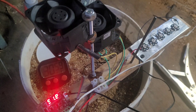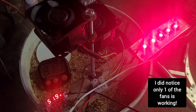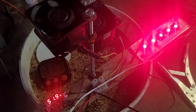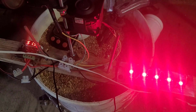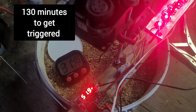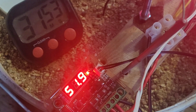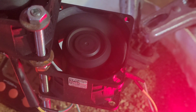It's getting close now, my friends — it should trigger at 52.1. We've got 280–300 going to the dump load. It came on! Woo! Yes! Thank you — it works! These fans are blowing a gale. Just noticed only one of the fans is going, but that one is definitely going.